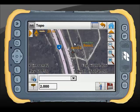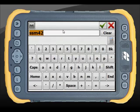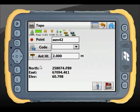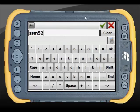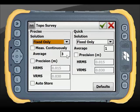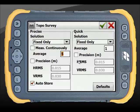Once I'm on my SSM, I would go in and change my point ID to the same point as my SSM. If you're unsure, go to Magnet, Edit Points — and it was SSM52. So I'm going to change my point ID to SSM52. I can use my precise or my store button. In this case I've got my precise set up at three. I'm going to auto store and change that to five. Depending on the type of location you're in, you might want to increase or decrease that. I'm now going to use my precise reading.